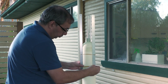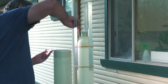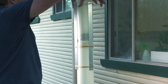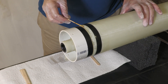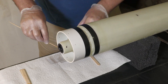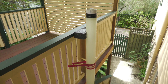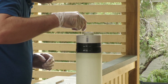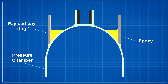For alignment we use three aluminium angles spread evenly around the top of the pressure chamber, held down with rubber bands. We put the ring inside the payload bay tube, dab a few spots of five-minute epoxy, and slide it down between the angles. Once set, we pull off the tube and angles, fill the joint with 24-hour epoxy, and wrap electrical tape over it for a smoother finish. We then stand the pressure chamber upright and pour more West Systems epoxy into the space between the chamber and ring for extra strength, letting it cure overnight. A cross-sectional diagram shows where the epoxy ends up.